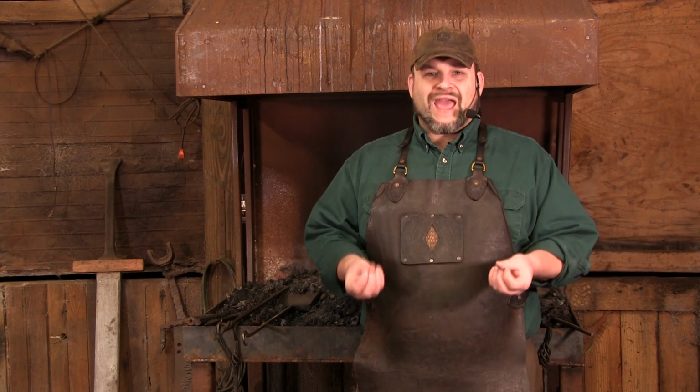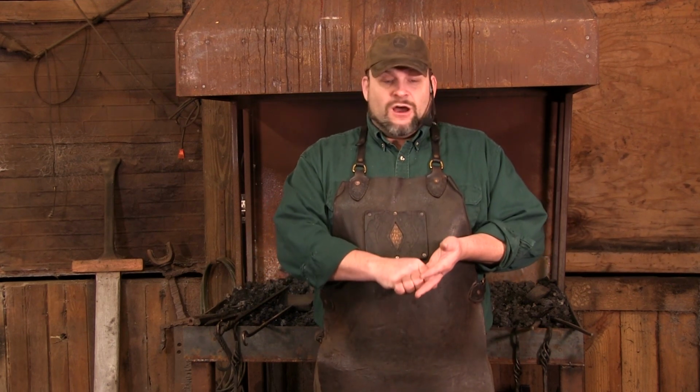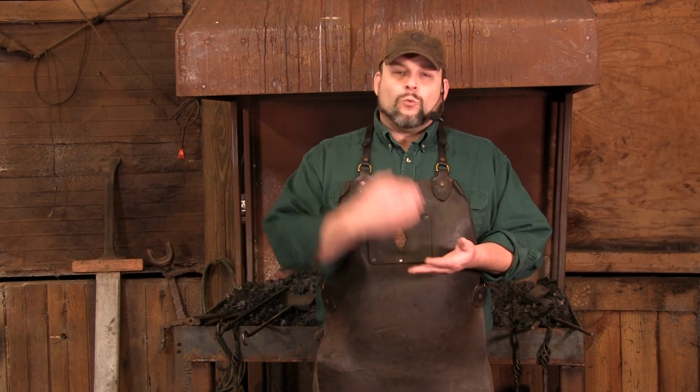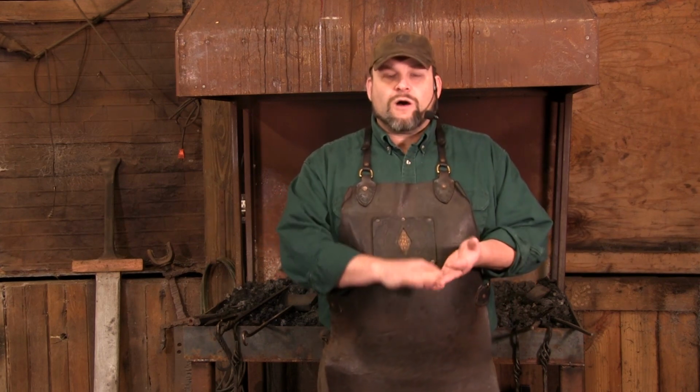Now, as you get into the later 1800s, a new technology came out that they could pour cast iron. And then you saw the rise of things like Fisher-Norris and Vulcan anvils, and these are anvils that are cast iron, which is an inferior material, but it still had a steel top plate. If you wonder why professional smiths like myself won't touch Fisher-Norris or Vulcan anvils unless they're just going to be ornamentation, it's because once that top plate cracks, and they do very often, it's very difficult, very expensive, if at all possible, to repair them. They just don't make serviceable good anvils for a professional shop. For the beginner, probably okay, but they're just not a quality piece that smiths like myself always look for.